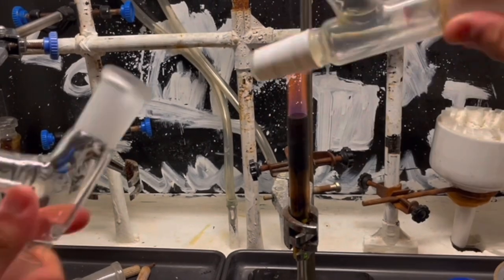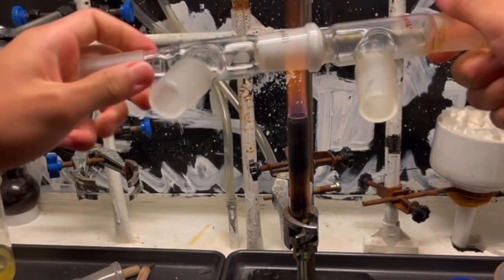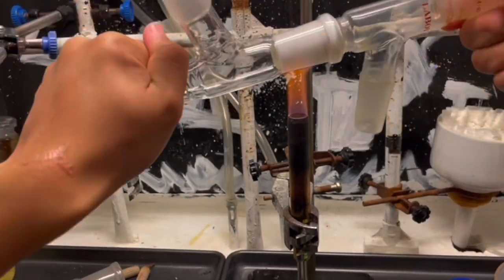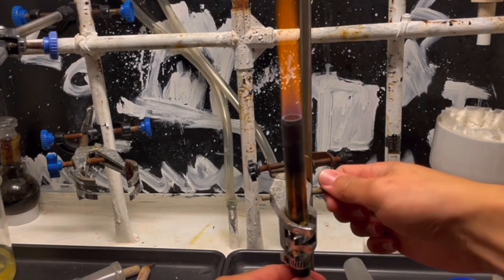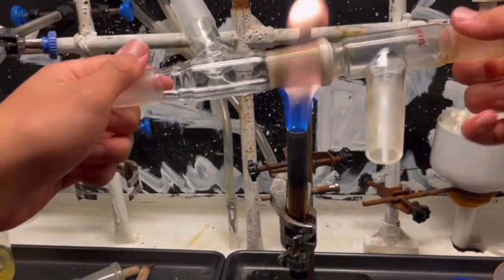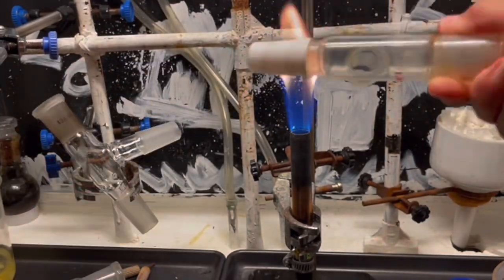Occasionally heat up the inside of the glass as well because we want the Teflon to be thoroughly sintered together. Basically, we're softening up the Teflon enough that it's able to stick to itself, but not quite molten. Now, the original plan to make a better product was actually to use a heated aluminum die press, but then it's getting off track because it's no longer accessible by amateurs. I want this to be accessible by amateurs, so I'm going to leave it like this.